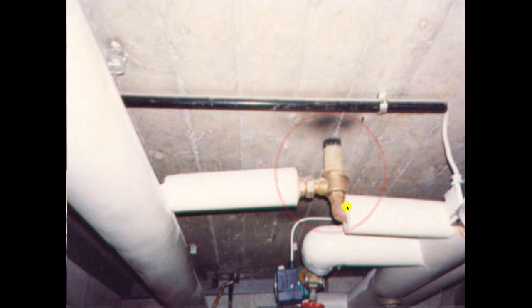It's sort of a relief valve that doesn't pop open — it meters itself open and has a knob on top. To set it up, you start with all the control heads removed from your thermostatic radiator valves throughout the building. The differential pressure regulator sits in the boiler room from the pump's discharge back to its suction side. You turn the knob while feeling the pipe, and as soon as you feel hot water creeping through, you turn the knob back and leave it on a hair trigger. Then you put your thermostatic radiator heads on, and when any one shuts down, the flow goes across the bypass.